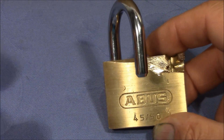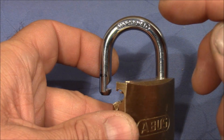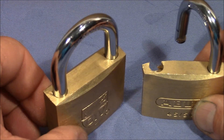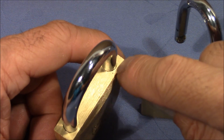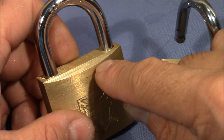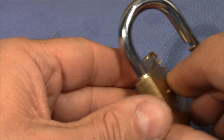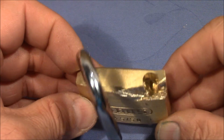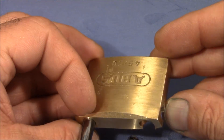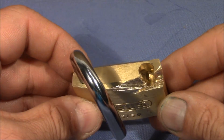You've seen I even held the padlock in my hand and it was not a big deal. So no matter how hard the hardened steel shackle is, no matter how thick it is, no matter how big the brass body actually is — you still have this vulnerable thin part of the body that can be cut really easily. If you manage to open a little window, you can twist out the shackle and open up the padlock. Criminals know about all kinds of attacks for these padlocks, so think about what kind of padlock you want to use. If you really want to secure some valuables, maybe brass is not the right choice.